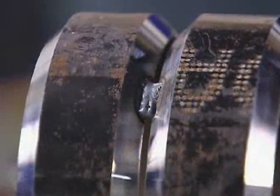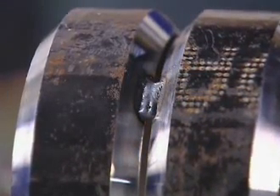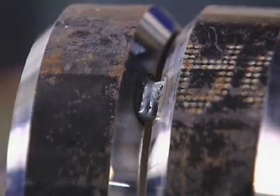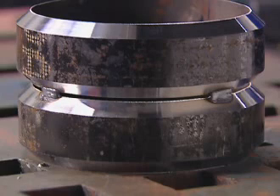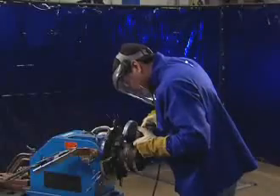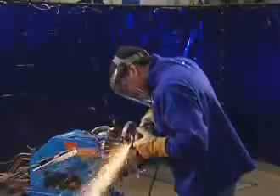On a larger pipe, your tack welds may be 1 inch or larger. On a smaller pipe, they may be 1/4 to 1/2 inch long. Tack welds will shrink during cooling, causing the joint to close up. In tight areas with less than a 1/8 inch gap, you may need to grind the joint using a 3/32nd inch cutting wheel to open the root.